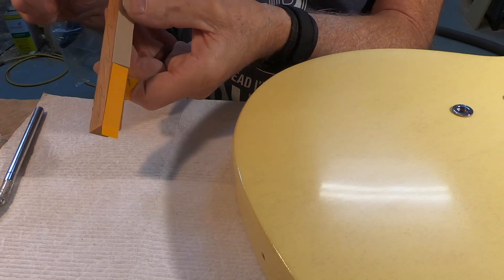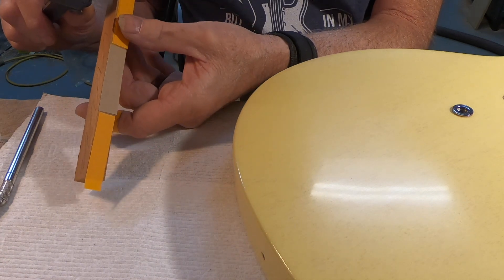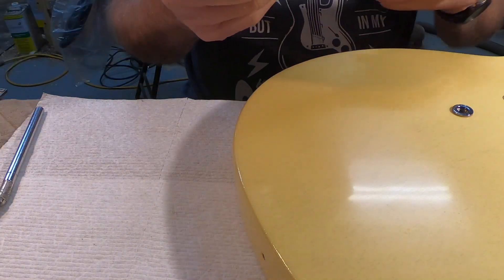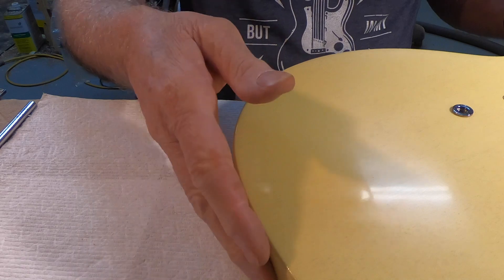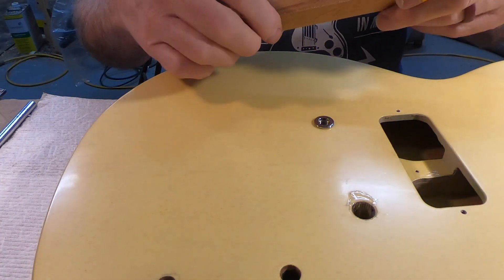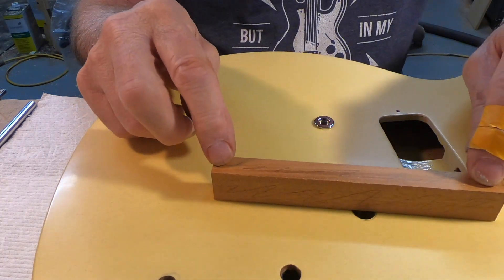Let me measure this stacked up — yeah, it's giving me thirteen thousandths on both pieces together. So we have virtually the same thickness on the masking tape as we do on the sandpaper. And you can see I still have a rock where the lacquer has been built up, because there's a hump there.